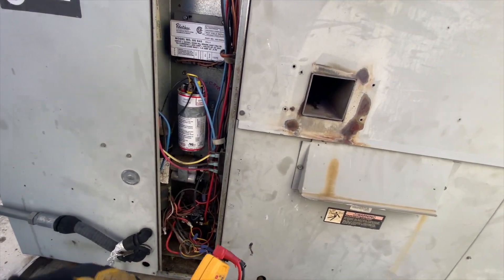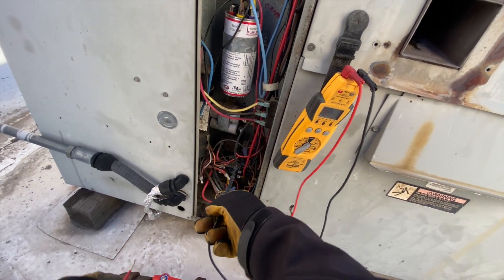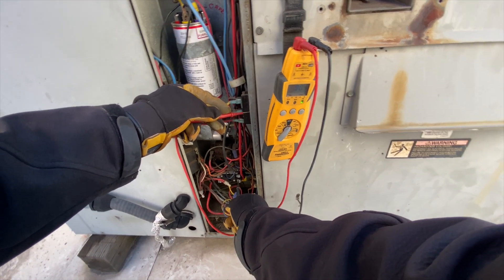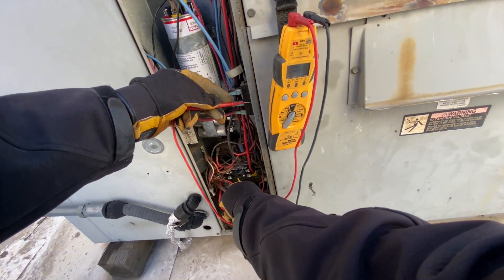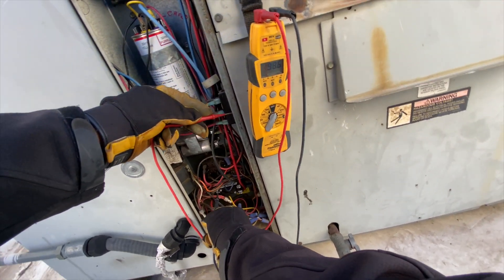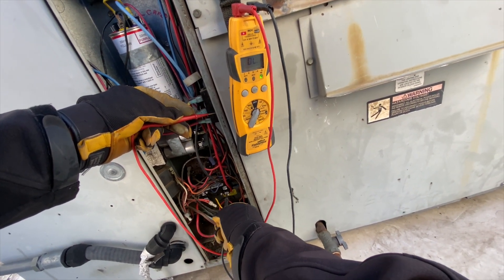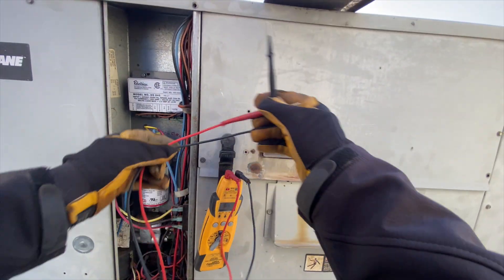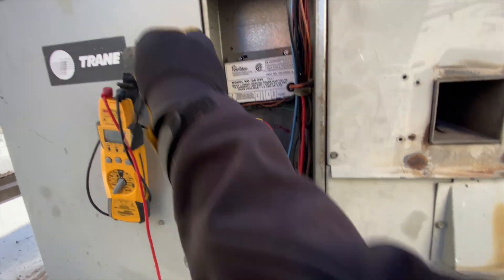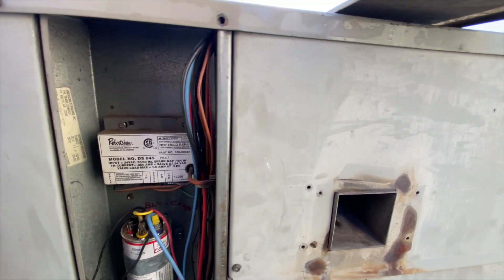A quick easy way of doing things: go ahead and turn the power off, then find where your power goes in and check for continuity. It looks like we have some kind of short on the main power lines — that's not good. From here to here it's fine, but from here to here we have a short, and here to here we have a short. Generally we shouldn't be getting any continuity. I'll check between line one and line two — yeah, there's some kind of short going on, so we need to find it.